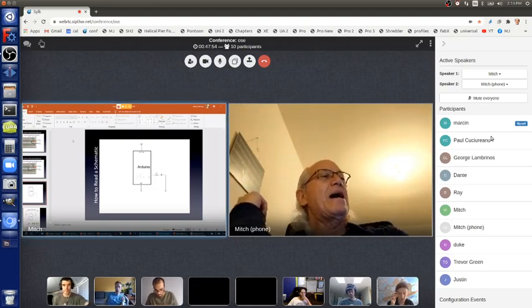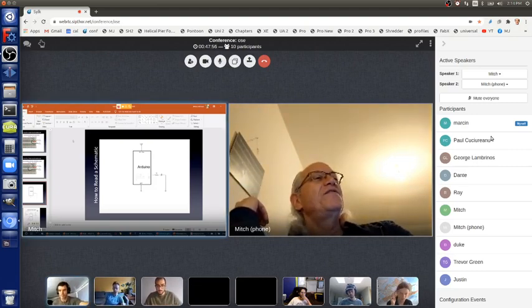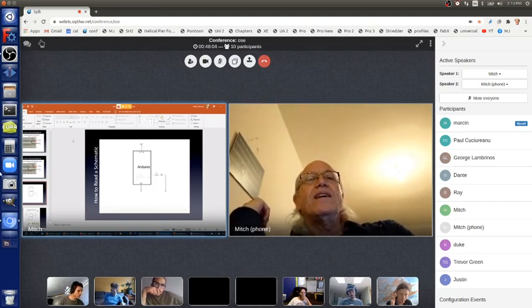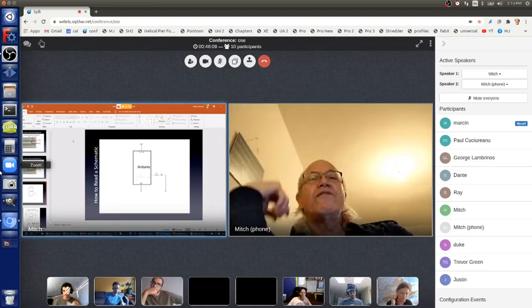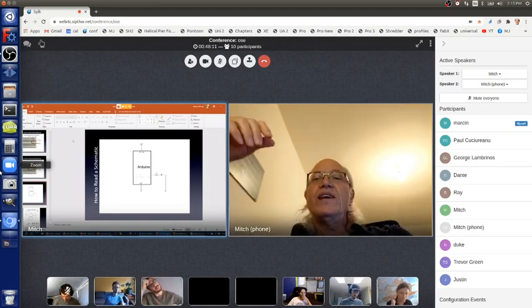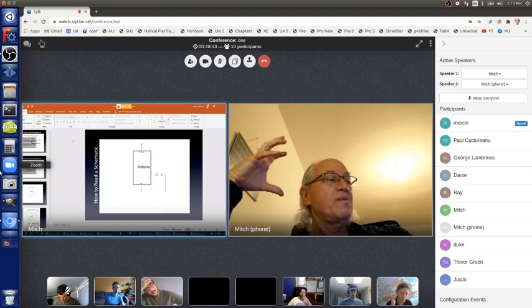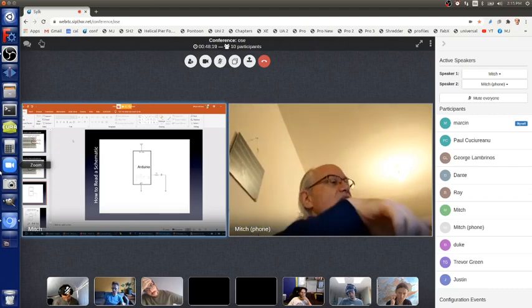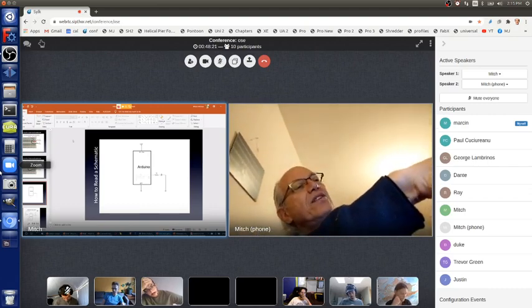And now look in the middle on the top, and it's 5V VCC. And then you see a line of wire going to a little circle marked with 4.5 volts. That's the symbol for power, and it's usually marked with the voltage. In this case, we're using a power pack with 4.5 volts, three AA batteries. So we can do that, and we can use that for a power supply.